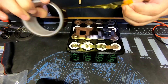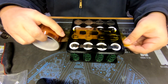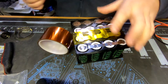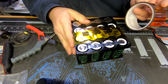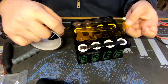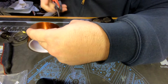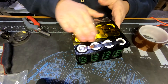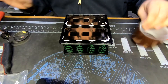Just so we don't have any accidents, we're going to put some Kapton tape on this. You definitely do not want to short these out. Lithium iron phosphate is much safer than your typical lithium chemistry like an 18650 or a LiPo cell - they don't really explode like those do - but nonetheless, I still don't want them shorting out.